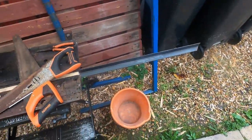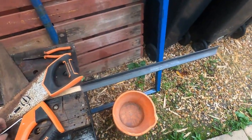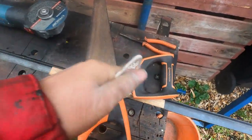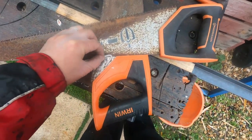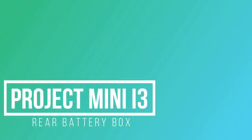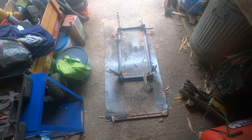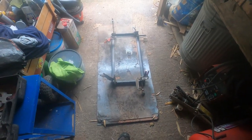I'm quite pleased with myself actually. I'm starting to make up the frames for the battery boxes and I didn't have any protractor or angles to make sure the angle was 45 degrees, so I found something that was about right. To check it, I put a saw across another saw and then I can just put that up there and check. That is good enough for me. I've got all these battery boxes cut up and clamped. I've checked side to side, both bands, and lengthways just to make sure it's square, so better get it welded.